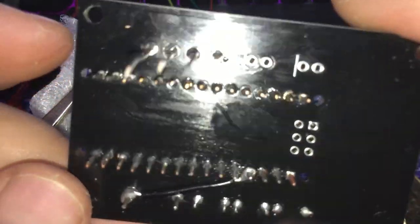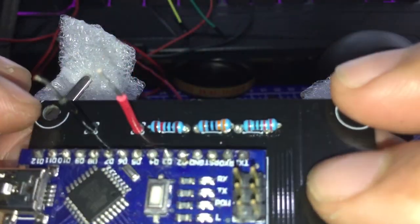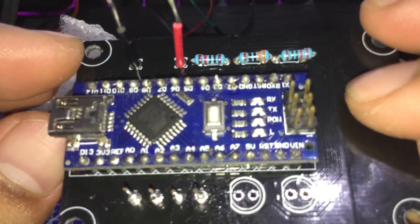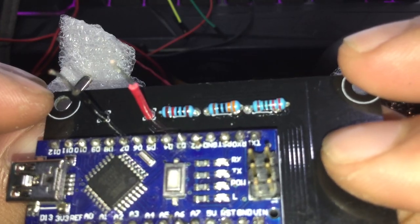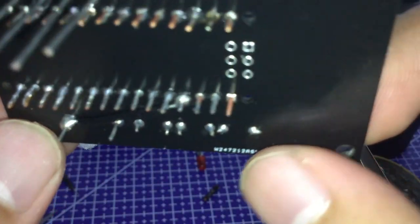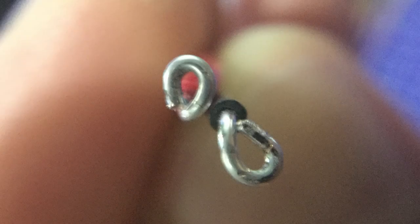We have to continue on connecting some of the terminals that I forgot to route to ground on my layout. We're done soldering the ground wire of the switch to ground 1 of the Arduino. We did that earlier. Now we have to connect the ground lead of the LCD to the ground 2 of the Arduino. We're going to make a little hoop so that the wires won't move around when soldering.